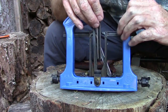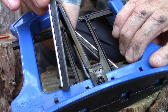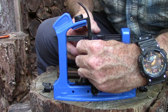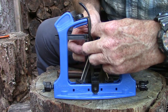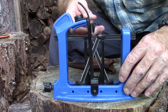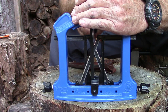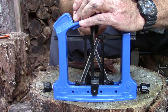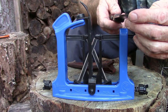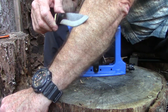Down at the bottom they've got different degree settings: 17, 20, 25, and 30. Most bushcraft-style knives are going to be at about 25 degrees, so that's what I'm going to set this one at. You set it on the notch and click it in — do both sides. The last adjustment is the blade width runner: set your blade against it to get the right width, tighten it up a bit, and then it's as simple as just sliding the knife straight down through the V.